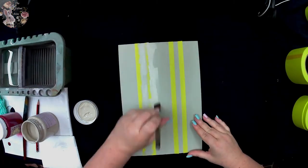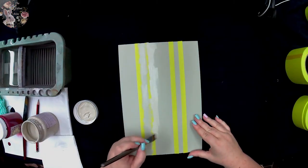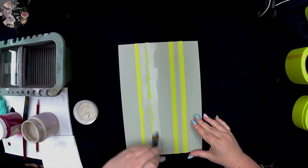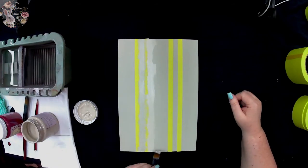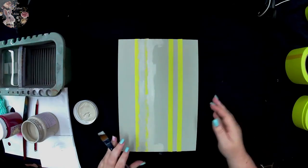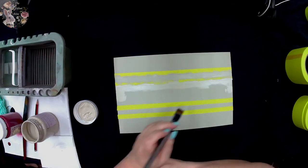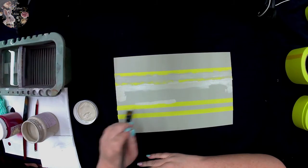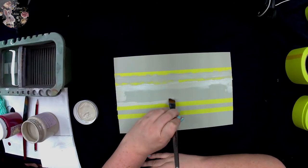I've painted over the tape a bit — that's going to dry. I'm now going to carry on and paint into my stripes. Remove any ridges and smooth it out — ridges are going to be a problem, especially if you want to do any technique over it. We're going to paint in and then smooth it up and down. It's going to dry the same color as your base color so you won't have to worry about that. Always paint into the tape, not away from the tape — into the tape.